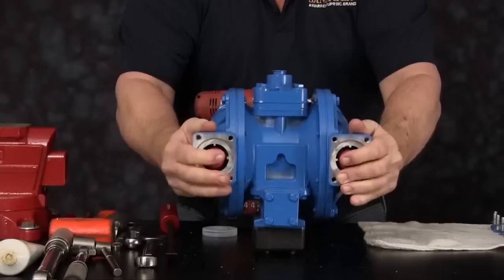Once these are installed into place, roll the unit over so the suction side of the pump is up towards you. Install the suction balls. Install the suction seats — the seats can go in either way, there is no up or down, they can go in either direction. We are now ready to install the suction manifold. Inspect the face of the manifold where the seats go for integrity. The suction manifold can go on in either direction for customer specifications. Install the eight cap screws that hold the manifold into place. Please notice the gap between the suction manifold and the outer chamber — this will not be a face-to-face casting. These are a hard seat so it will not squeeze completely together.